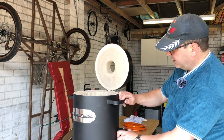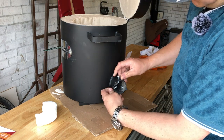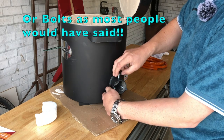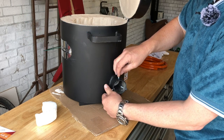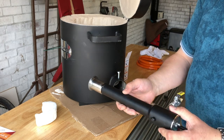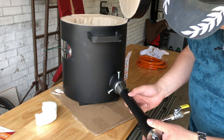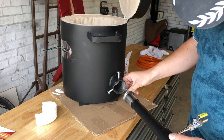Next thing is, look at putting in the burner. So this is where the burner goes. You've got three nuts that can be wound off. These haven't got to be particularly tight when the whole thing's installed. They just centralize it really. Here's our burner, and that's got to go in. And that tells me you've got to take these bolts almost all the way out.